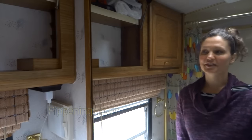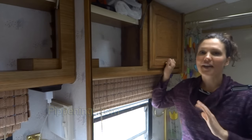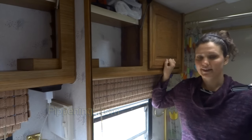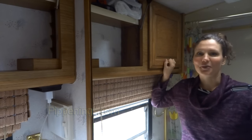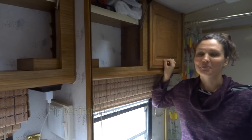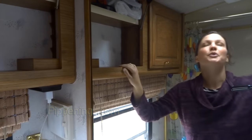So the first thing I want to figure out in this whole process of getting the electricity from the roof down to the bin is where exactly I'm going to run my cables. Now, I have ruled out the option of running them down the refrigerator vent, drilling holes into bins and then drilling holes through bins. I've ruled that out, one, because of the little bit of extra work, but two, because it adds maybe 20 or more feet to my cables. And that just adds up, plus the multiple holes I'll have to drill all throughout the RV. So I'm going to either do the hole in the roof or run it through the vent in the bathroom here.